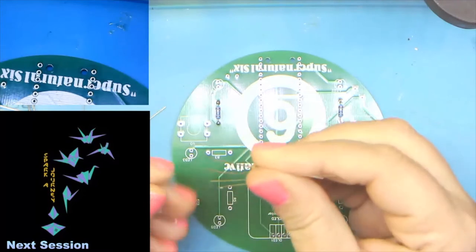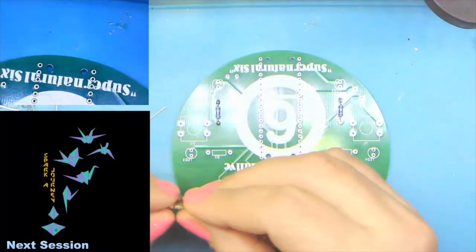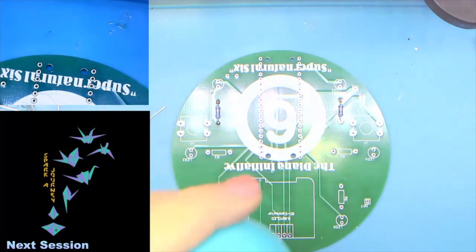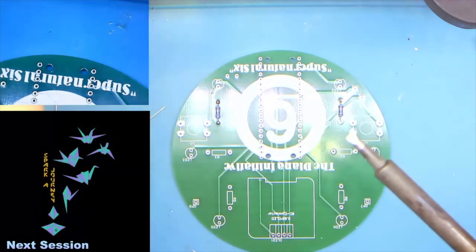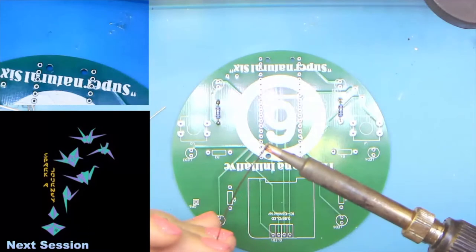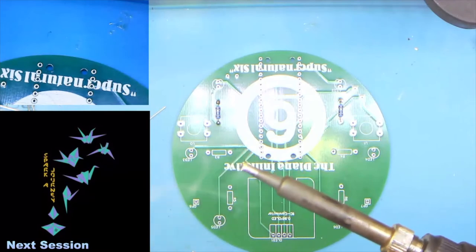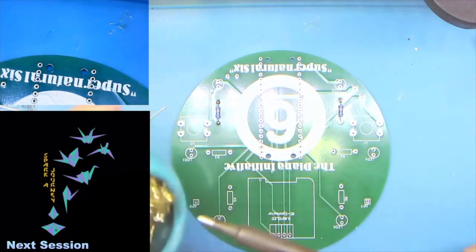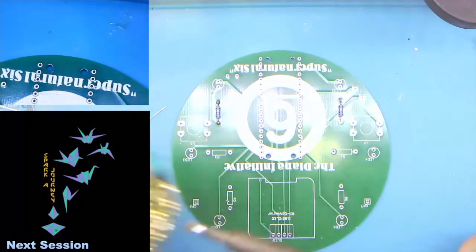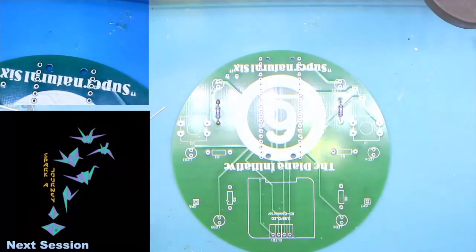What am I doing wrong if the melted solder climbs up the iron and not on the board? Clean the tip. The tip of your iron should be shiny. You may need to tin your tip, which is basically we take a little solder and we melt it onto where it needs to be shiny, and then clean it again. Almost time for a new one. All right. And then it will again be shiny, and flow much faster.